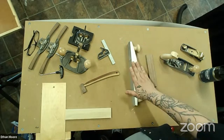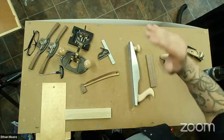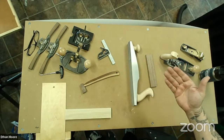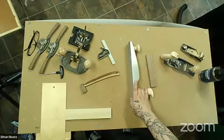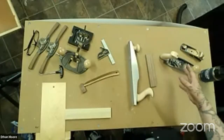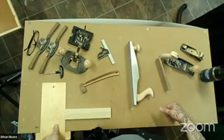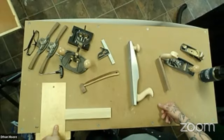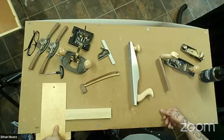The blade — we recommend that you do a final honing on the blade. It's what we refer to as factory sharp: it's been flattened to a reasonable level, it has a very nice grind on it, and it will take a shaving. Every time I pull a new one of these out of the box, I try it to see, and it does take a shaving as you'd expect. But we recommend for that last little bit, just give it a hone. That's how these planes came to be — in Australia they got tired of not being able to get a decent plane for a decent price, so they fixed it. I think it's a brilliant idea because it means more of us can get into using hand planes, since a lot of people hesitate to spend $350, $450, or $500 on a hand plane. If somebody can get one for a reasonable price, more people will give it a shot.